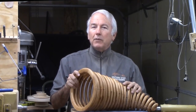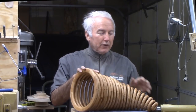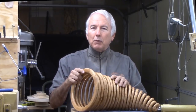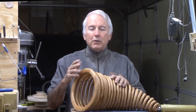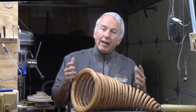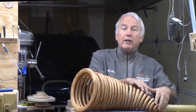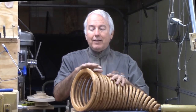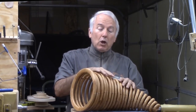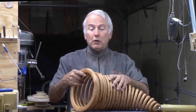I've studied this for quite a while. I thought I should make one, but it's real tough to get kind of a curved shape to it. I thought of tapering the segment rings and figured out a jig for that, but then I wasn't really happy with what it would take in the end. So I decided to use negative space in this one — just make the rings. There are 22 rings here, then tie them together with wire so that the extra space that would accommodate the curve is actually negative space and it actually contributes to the cornucopia.